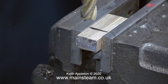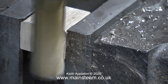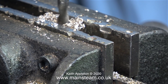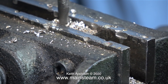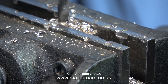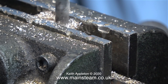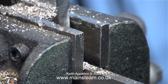Now it's time to make the gunmetal block to fit on the end. Before cleaning off the end with the milling cutter I cut the block to length, then it was over to the drilling machine. I need to make two tapping-size holes for 5/16 by 32 threads-per-inch that go down into the block but not all the way through. I did this entirely by eye — I've mentioned the calibrated eye many times in these videos. It doesn't need to be made with micrometer precision because it is not a precision part. I drilled the holes in two stages: first using a quarter-inch drill, followed by a 9/32nds of an inch drill, so the hole cut better.